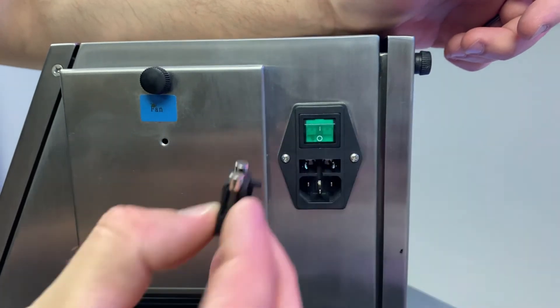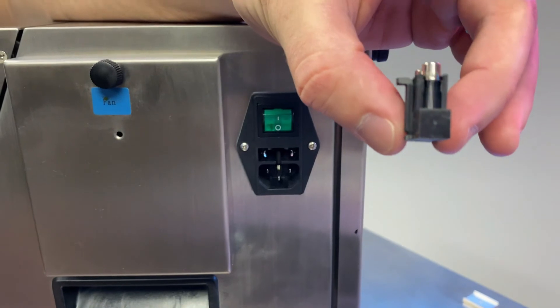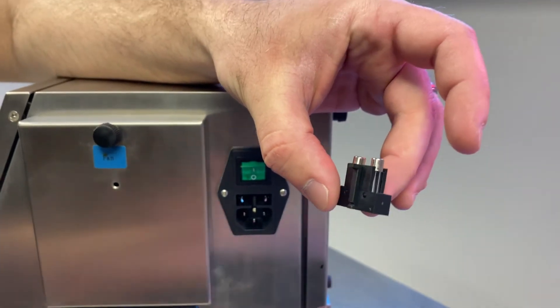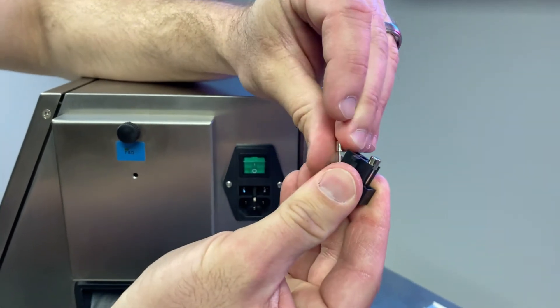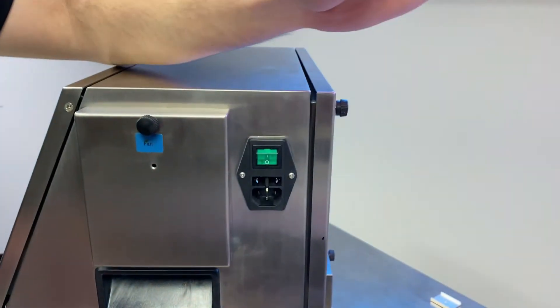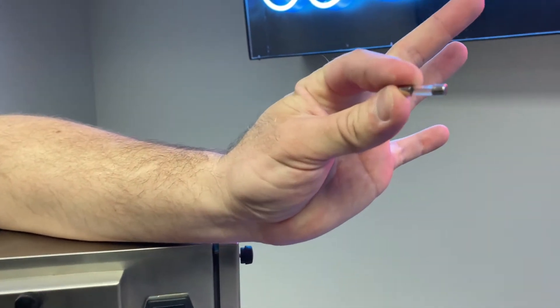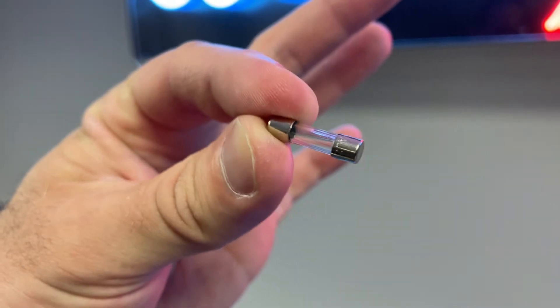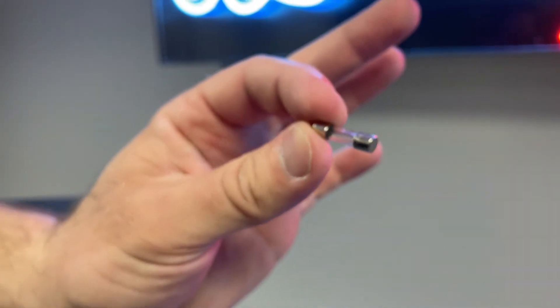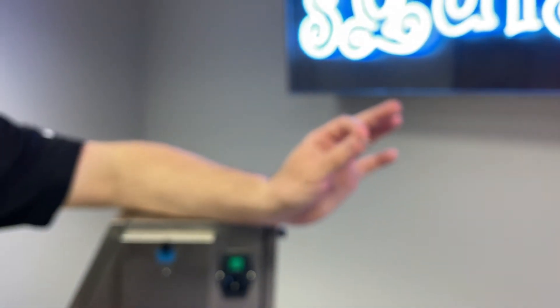If we slide this out, you'll see we do have a pair of fuses. These are four amp, 250 volt rated fuses. It is typically really easy to see if one of these is shot or blown. You'll see the little rod inside — this one is still intact, there are no breaks in it. We will also meter this out just to be certain. The fuses are really one of the first things you want to take a peek at before we go any further into the system.